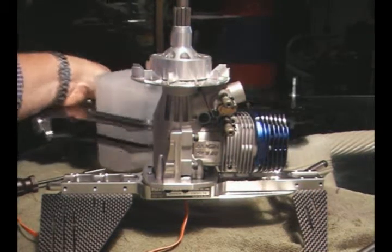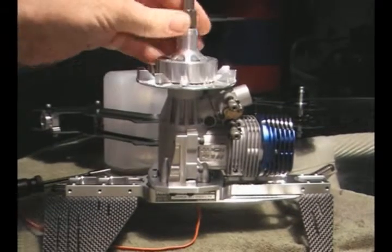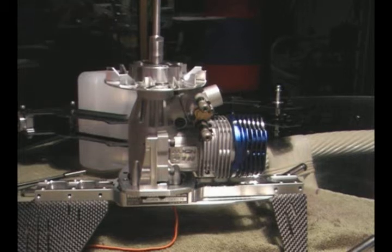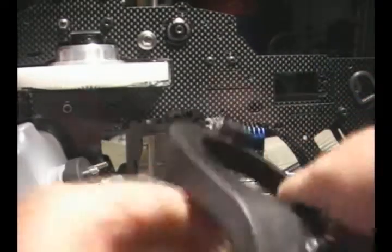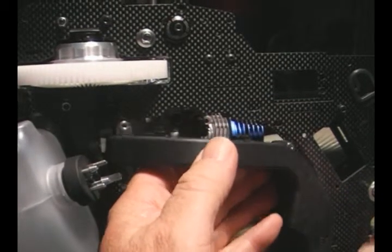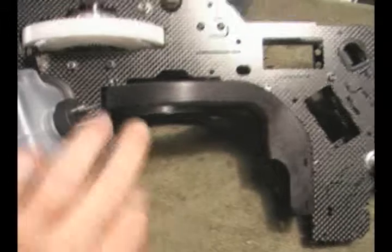Lift the top off. Now, the starter shaft is normally going to have a coupler on the top of it, but that's only going to be 1 hex bolt to come off. But look how easy it's going to be to service this clutch. 4 bolts, lift the clutch off, and you're onto your clutch down there. That's just brilliant. Okay, now we'll mate up the fan shroud into the frames, and then we'll do a trial lower down on the engine and see if it all fits. No big surprises here. The frames lay flat on the side.